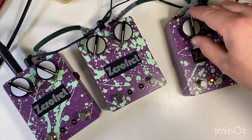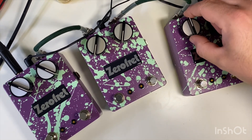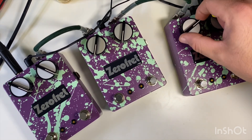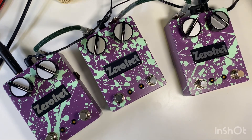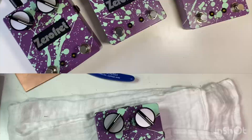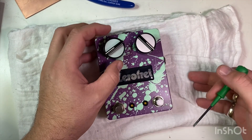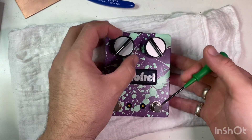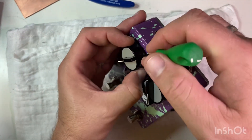What that means is I need to do a quick — pain in the bum — job of replacing this potentiometer, which is a real pain because it's soldered into the circuit board. But I can do that quickly, and then I'll come back and it should work. So I'm going to quickly remove this knob, open the back, disassemble it, and have a look at the pot.